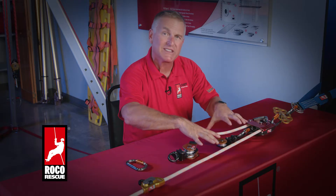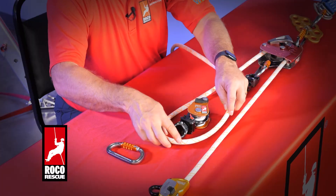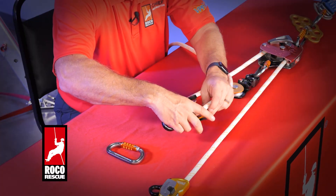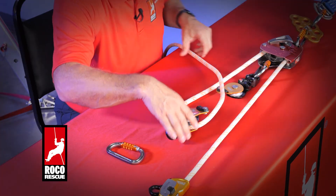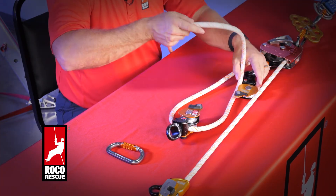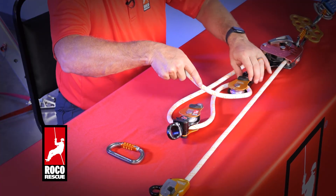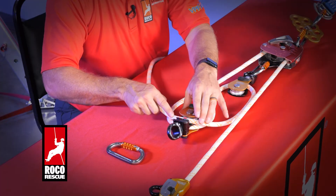Now I'm going to wrap this in a coil to keep most things internal to those two lines running parallel to each other. I'll bring this in, turning to the inside, and put that pulley on the bottom loop. I'll close that up, then come back and go through this loop facing away from me, and close that up — which allows me to bring that rope through that final sheave.